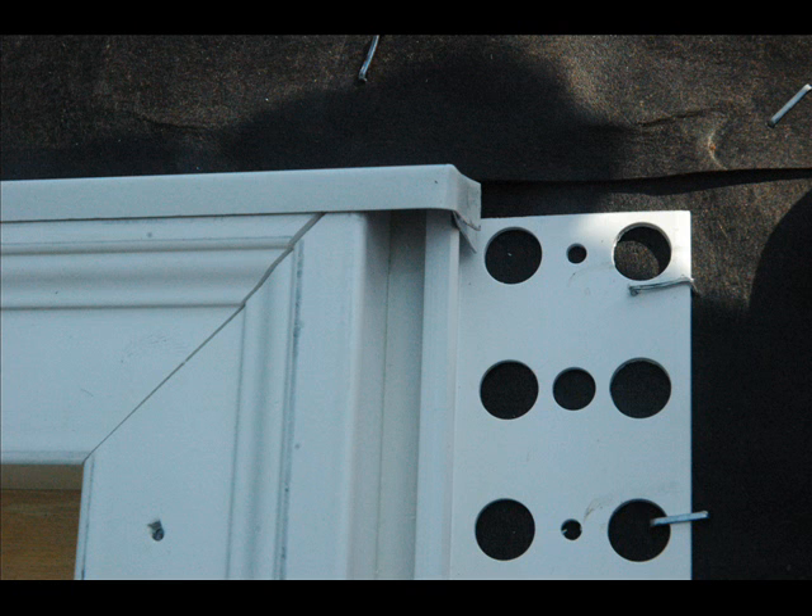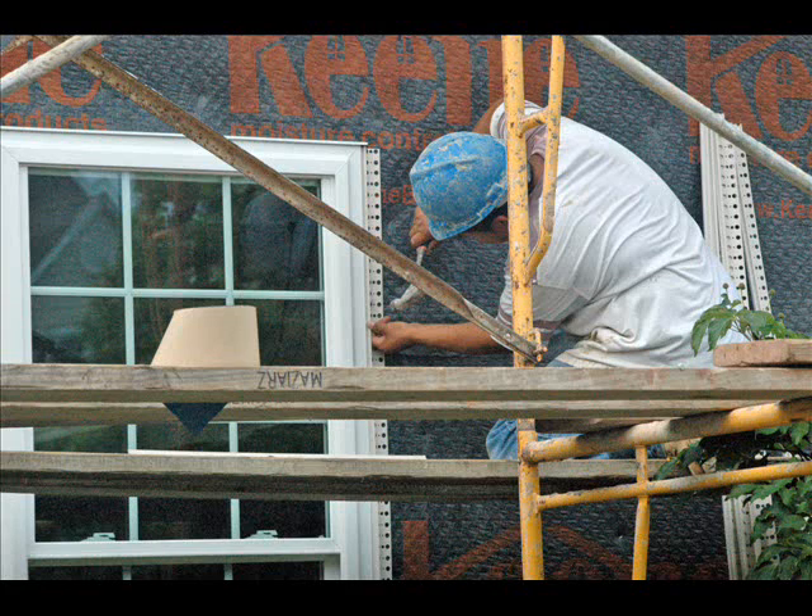We also want flashing installed at the top of our windows and doors to allow water to shed from the wall. Now, another critical part of a stucco wall also often overlooked are joints installed where all dissimilar materials come into contact with each other. Here we have Easy Bead, which is a type of casing bead that has an expansion material built in, ready to caulk. Casing beads are required. Stucco moves at different rates during freeze-thaw than vinyl, wood, metal, etc.